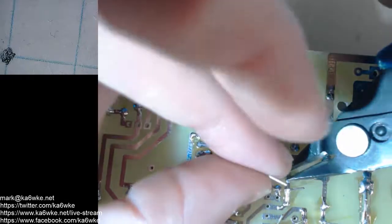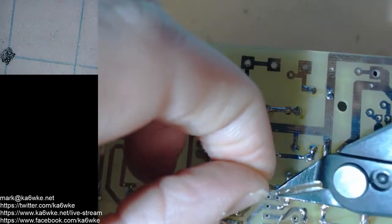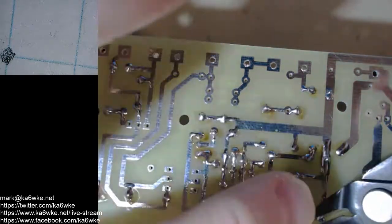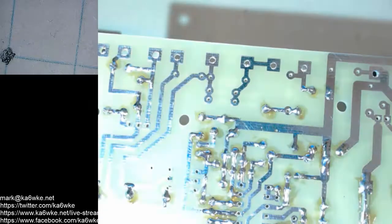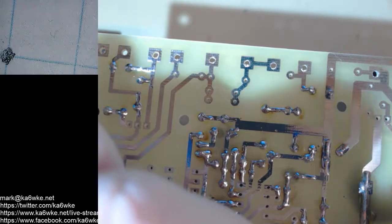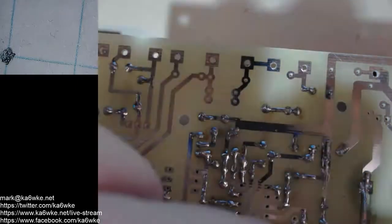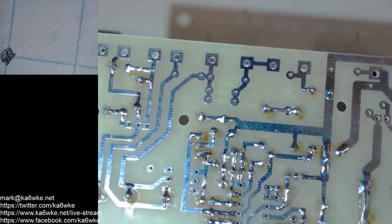Because when it's sitting for a while and it's hot, it starts oxidizing the tip, oxidizing the tinning off the tip. And that's not good. You'll have to replace it rather quickly. I have tips that are probably 10 years old, and they still work fine. Tin them up. I covered how to tin your soldering tips in your first kit, episode 5. So you know how to do that. And even when I'm going to turn this one off, turn the soldering station off.